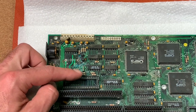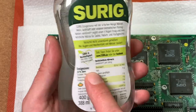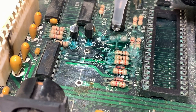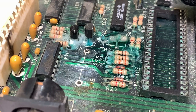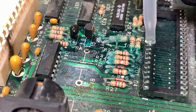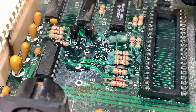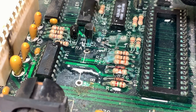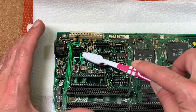To neutralize the chemicals which were leaking out of the battery and going inside also the vias and the board, I'm using some vinegar. Actually, this is concentrated vinegar with 25% acid, so it's quite strong. When you put the vinegar on this stuff, you can hear the reaction which is ongoing. When you have enough vinegar on the PCB, you just take an old toothbrush and you clean gently the area with it.